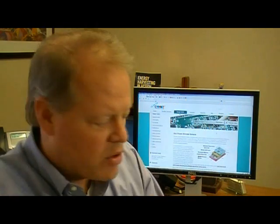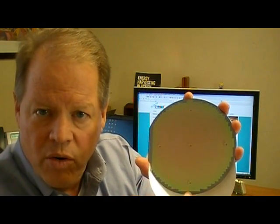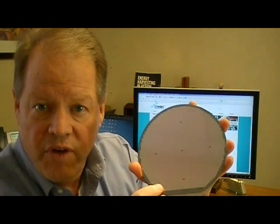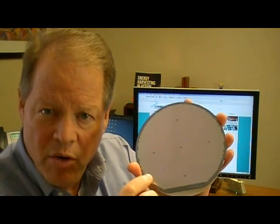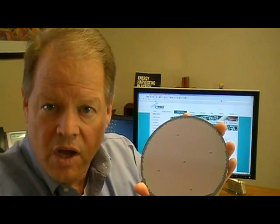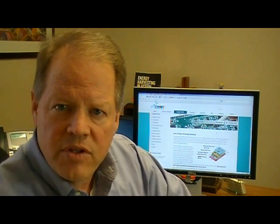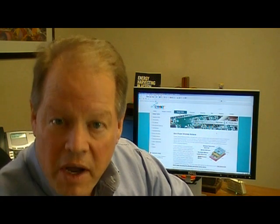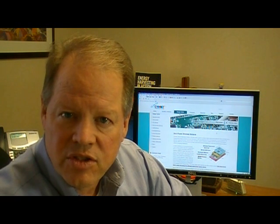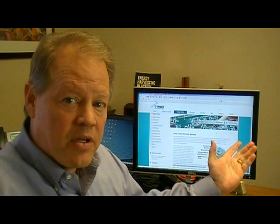We build the 50 microamp hour devices. This wafer has the standard 12 microamp hour device on it. We also build standard product as five microamp hours — you can see they're getting very tiny, very small. All of these devices are available, for instance, at Micross, who specialize in bare die distribution and device fabrication. We even take the devices down to one microamp hour, which I want to show you in a very interesting application.